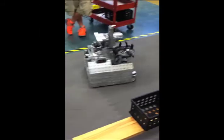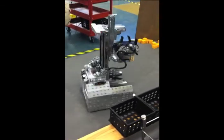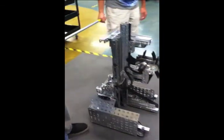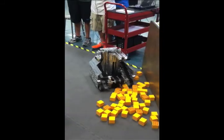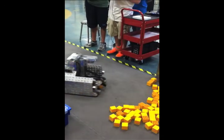For our robot function, it used a vertical lift on three linear slides that move using a rack and pinion. This assembly uses three motors and is chain driven, geared for torque. For our drivetrain, we use tank tread rollers, moved with one sprocket for direct drive.